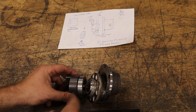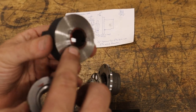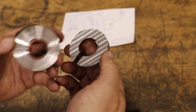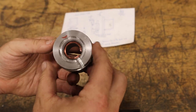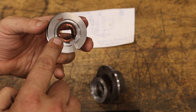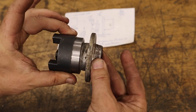I just finished up on the lathe. The main thing I was trying to do is put a bunch of parts together but keep them concentric. Notice how here with the red marker there is a raised lip, and that matches up with the interior diameter of this, so when you put them together they are centered — concentric with each other — which is good because they're all going on the same shaft. Likewise, I cut a step into this part right here and squared this bit off, so those go together just like that, nice and concentric.